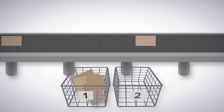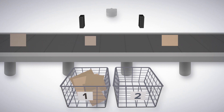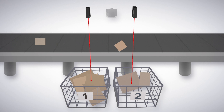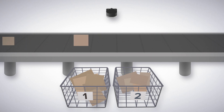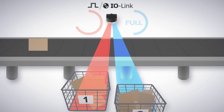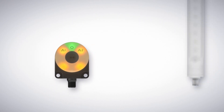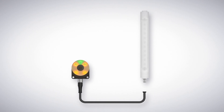When there are multiple nearby applications that need to be monitored, consider installing a single K50Z. Typically, a warehouse would need to deploy an overhead sensor for each bin. By setting up independently configured zones for each bin, both outputs can be sent back to a PLC where fill levels can be displayed. The K50Z also features PFM outputs, allowing you to directly connect the K50Z to Banner lights, enabling fill level visual indication without the need for PLC integration.